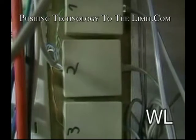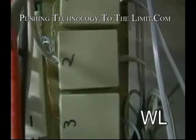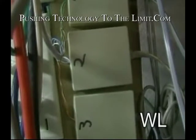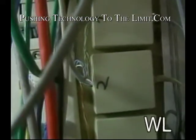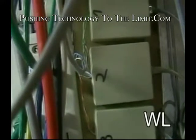Then if you want caller ID to show up on the other telephones, you have to buy a separate caller ID box, which I've seen over at Walmart for like $10, which is nothing. And then you only use 2 leads in any standard phone cable, so you can actually loop your phone service back to whatever part of the house you want, and have it with the caller ID box, so you can see who's calling your phone.